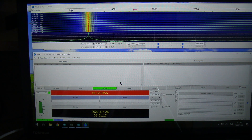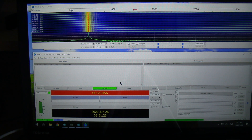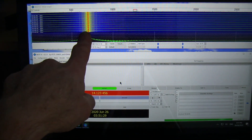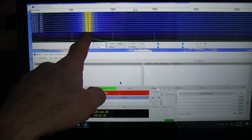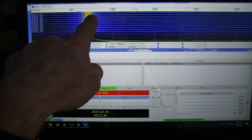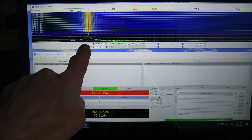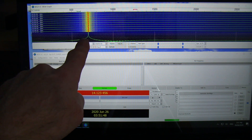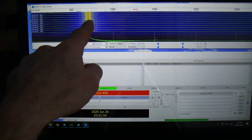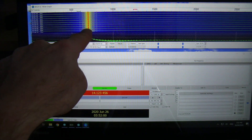What we see on the screen here is the WSJT software running with an oscillator, which we'll see in the code. I've just got a test oscillator sitting on the Teensy outputting 700Hz. I've got that at the lowest digital setting I can have in software, but as you can see it's still quite a high level — a very strong signal — but for testing out the logic it's fine. Once I get more into the radio, that will be coming from the line in through the digital filters before going back out again. But suffice to say, this is purely for testing how it's working — we can see the 700Hz there.